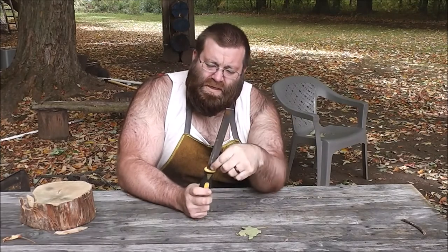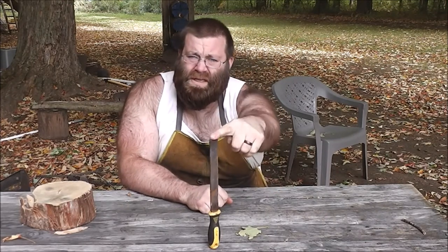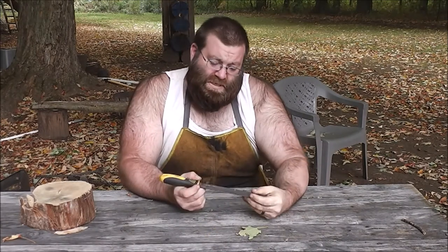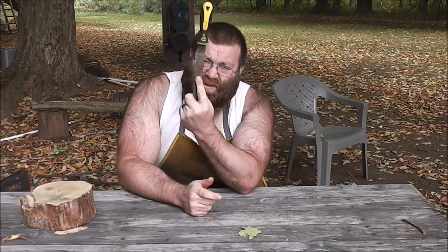What we're going to do is I'm going to heat this up, hopefully melt the glue that's in here, pull that handle off, then I'm going to heat it until it glows and stab it inside of a bucket full of ash to anneal it. Then we're going to get to work with a grinder or saw, whatever you have handy. You're going to need a triangle file, some sort of thing to cut it with, and a way to heat treat it. Anyhow, let's get to work.